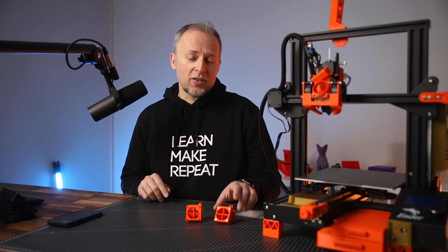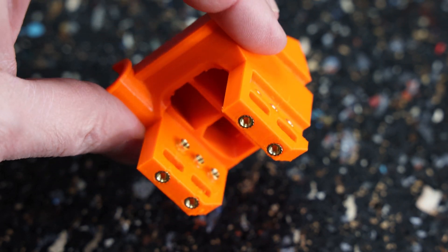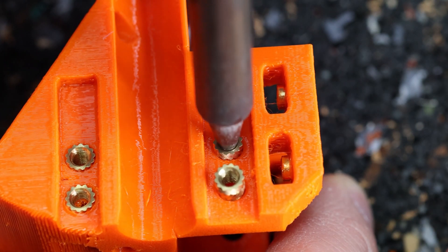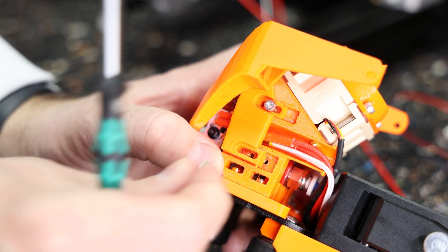So you had to somehow keep them in place while screwing on another part, either using some tool or double-sided tape, which was really super annoying. Gen 6 makes a huge improvement here by replacing all of the M3 nuts for the base with threaded metal inserts. These inserts are melted into the base by heating them up with a soldering iron and pressing them into the holes, so you can attach the base to the gantry adapter and the additional parts much easier and faster.